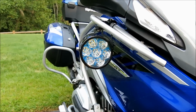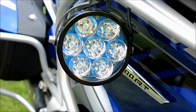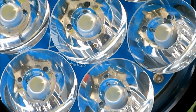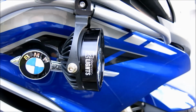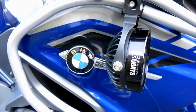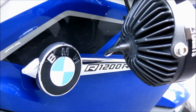The Sevina model utilizes a 4.7-inch diameter hard anodized black powder-coated CNC machined housing with integrated heatsink fins on the rear face. Each housing contains 7 super high power LEDs, which together are capable of producing a sun-shaming 7,500 lumens at full blast. Yet even set to 100%, each Sevina draws only 70 watts, a testament to its efficient power supply design.